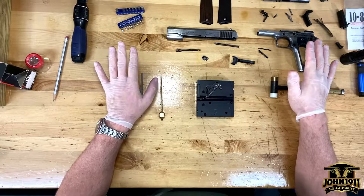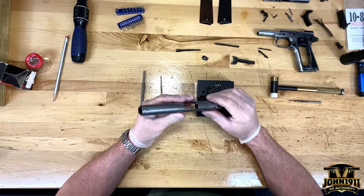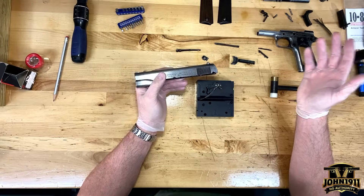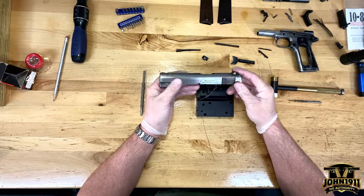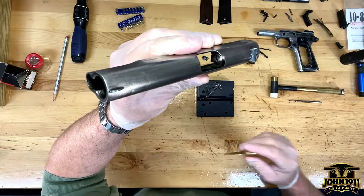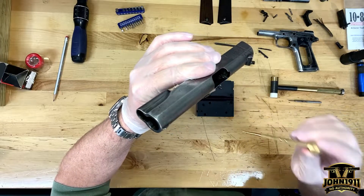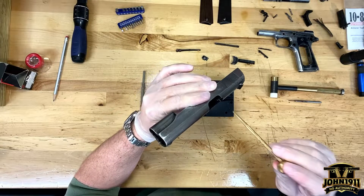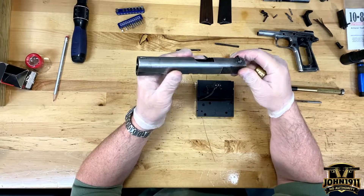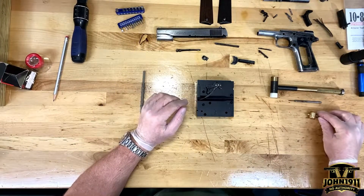I want to go ahead and talk about a couple of issues with this gun, some of them which I thought were going to be significant, which are maybe turning out not to be that big of a deal, but some we're going to have to address. This gun is 1914 year production according to the serial number. It looks like at some point somebody took a flathead screwdriver and hammered on the breech face, possibly trying to get the extractor out. So there is a line across the breech face. My initial concern with that was obviously things like primer flow, but looking at it — it's a .45 — I don't think it's going to be that big of a deal. We're not going to weld it up and try to fix that.